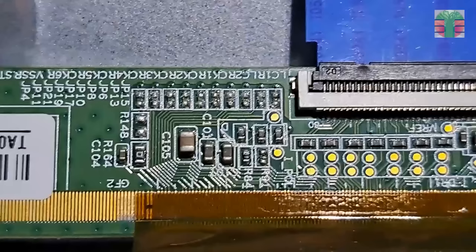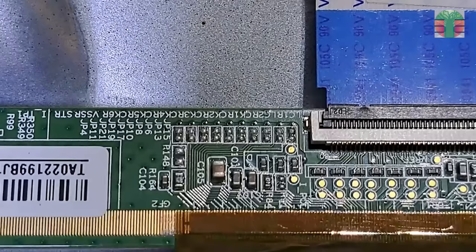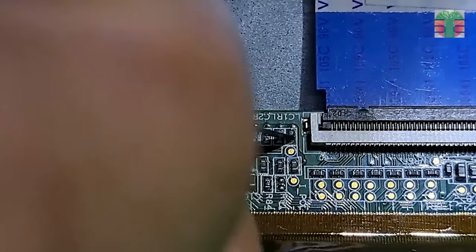The resistance between these lines is about 300 ohms and 96 ohms — these lines are the LC1, LC2, and CKV1. They have low resistance, so we are going to cut them. LC1 is also the VGH odd and LC2 is the VGH even.